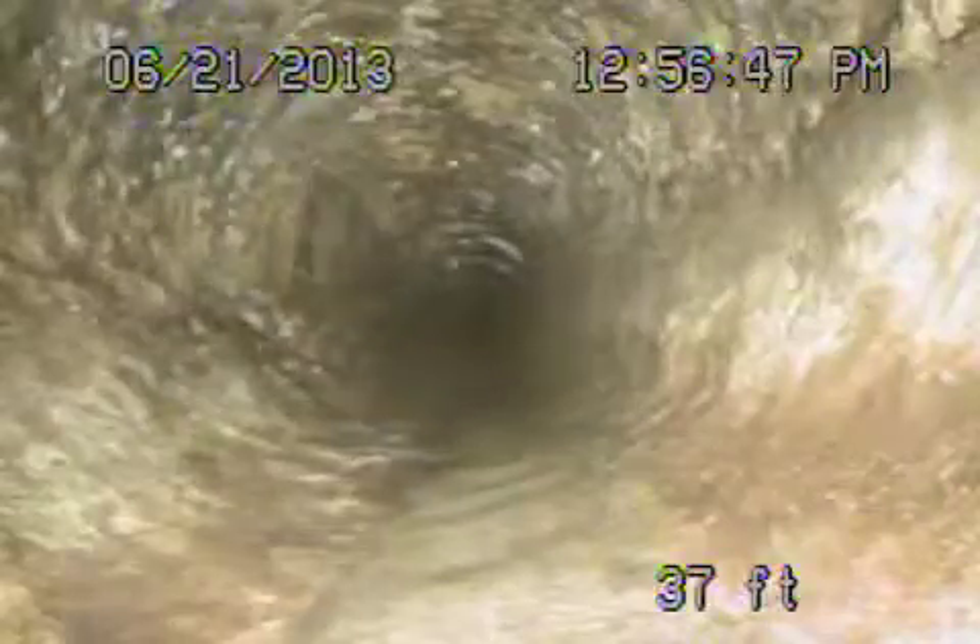You can see there's no water standing on the bottom — it's pretty smooth. Cast iron when it gets old creates a little bit of a valley, a groove on the bottom of the pipe, but you can actually see this is nice and round. So this is pretty good cast iron. This is underneath the house — cast iron, all in pretty fair condition.